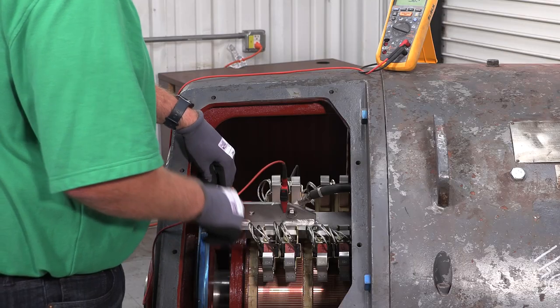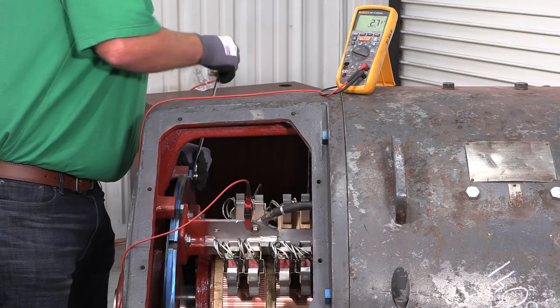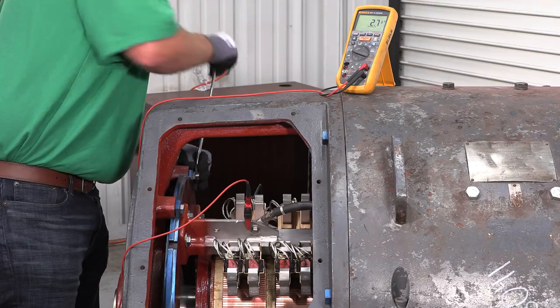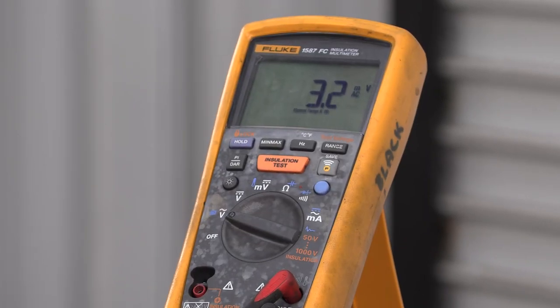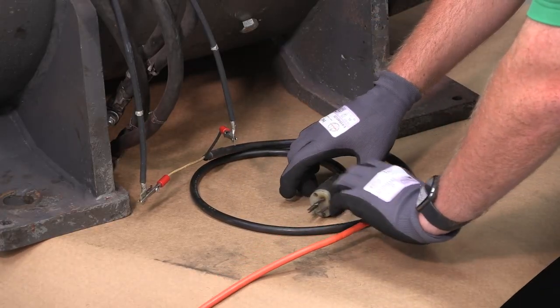Leaving the fields energized and the voltmeter leads connected, carefully tighten the brush holder fasteners. Cross-tightening the fasteners evenly allows you to maintain the lowest possible voltage. After tightening the fasteners, verify that the brush neutral setting is in a satisfactory location, and then turn off the power to the fields.